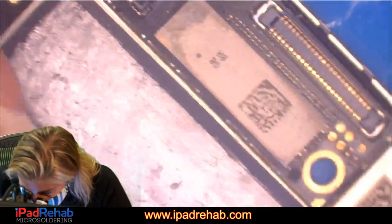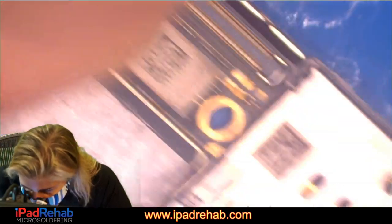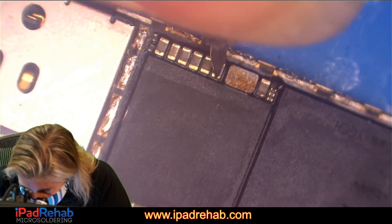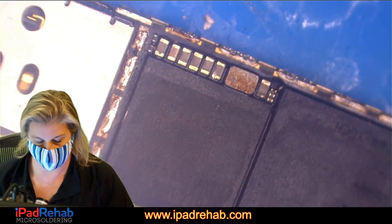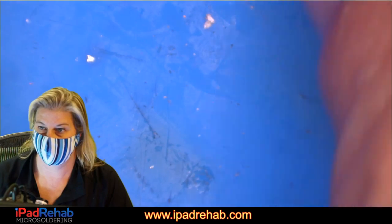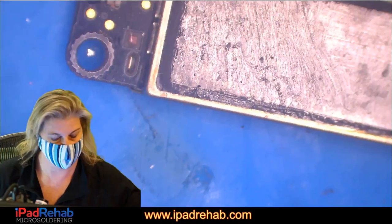While we're here, let's check that the battery line is okay. I think these guys are all main caps. Just make sure. Yep, 253. Okay, 253. That means there's a leak. And we're going to try to find out where the fire is. Where is the leak? By using strategy number 2: look for what gets hot. So let's see what gets hot.